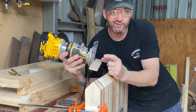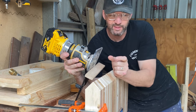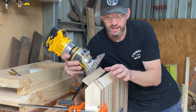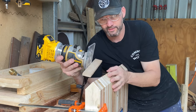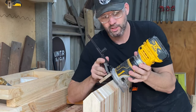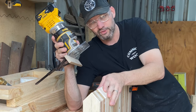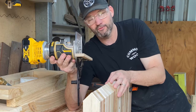Last time I used a slot cutter; however, the slot cutter had to hang out of the collet a little bit too far, so not entirely smart — it worked okay but there is a risk of putting too much pressure on that. So I've just got a straight bit this time and rigged up the fence on this little trim router, so I can cut the two slots I need to run a spline through the entire length of this waterfall edge. I think this is going to be the way to go from here on in.